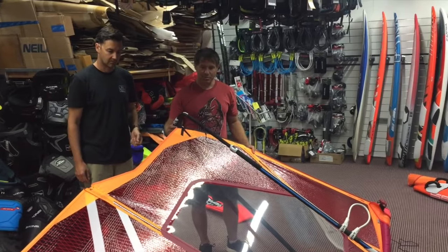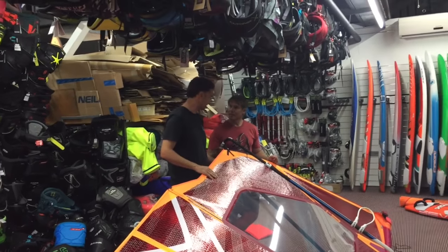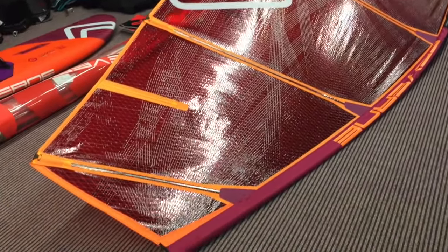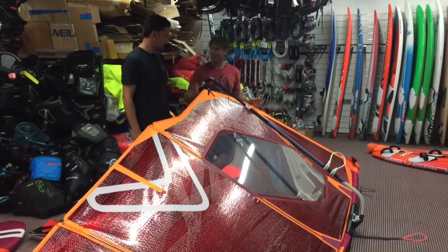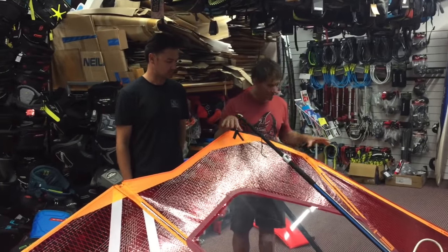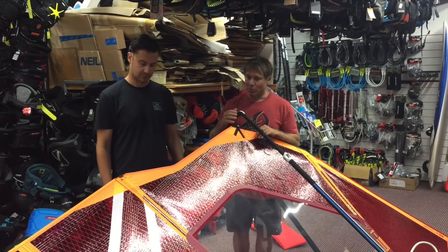And then the construction is probably the obvious thing. You notice it pretty well straight away as soon as you roll this out, the Pro construction. These membranes that we do are a bit different, but as a sailmaker, this is a wonderful way of doing sails. It changes everything, because instead of little patches of different materials to create the stretch characteristics or the handling that you want, you just do everything with fiber layout.